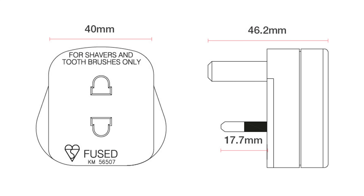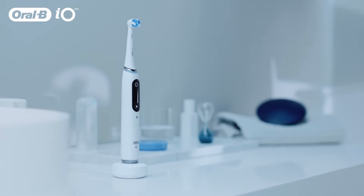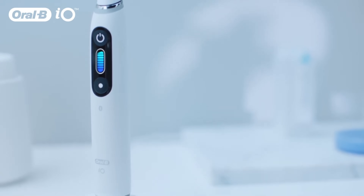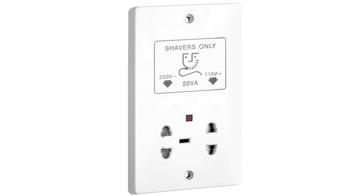Although curling irons and hairdryers are not something I've ever had to worry about. Shaver plugs won't fit into regular 3-pin sockets, even if you could get past the shutters that stop you doing silly things like trying to do that. Instead, you can use a shaver adapter, and there are even British standard rules defined for how these should work – they need shutters on them to reduce the risk of accidental shock, and will need to be limited with a 1 amp fuse and need to have the words 'shavers only' on them. Some people plug their electric toothbrushes into a shaver socket, but more and more toothbrushes and shavers are rechargeable, meaning there's less of a need for a dedicated electric socket in the bathroom. Will the shaver socket disappear, or will it be repurposed for something else? Only time will tell.